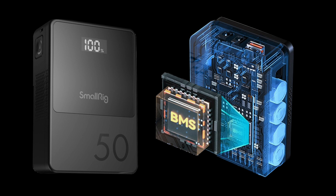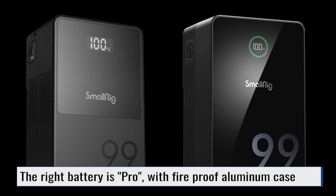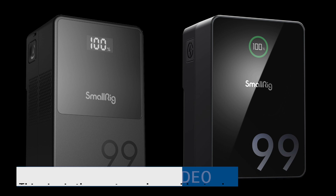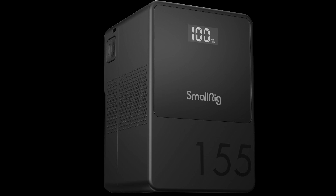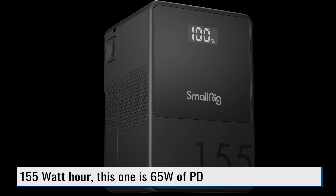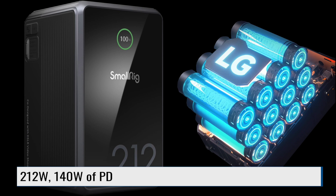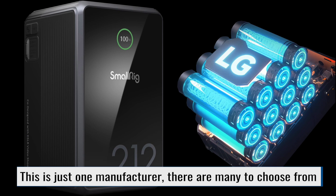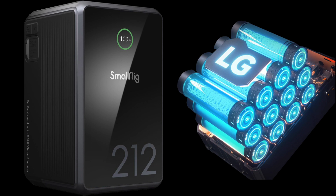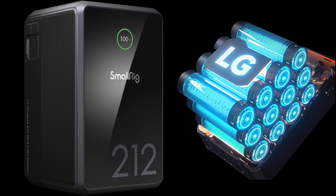These cells are connected to a battery management system. The 99-watt-hour batteries consist of four series-connected cells with two parallel groups, resulting in a capacity of 99-watt-hours. These are the most popular, as they are the maximum capacity battery that can be flown on a commercial aircraft. The next class up is the 155-watt-hour batteries - these are four series-connected cells with three parallel groups. As the batteries get larger, the cell type may remain 18650; however, some manufacturers use fewer, larger batteries. This results in higher energy density. The Small Rig 212 uses four 21700 lithium-ion cells in series with three parallel groups. These cells have higher capacities, which results in 212-watt-hours of storage.